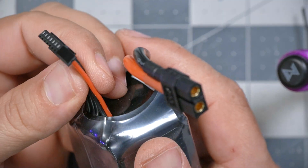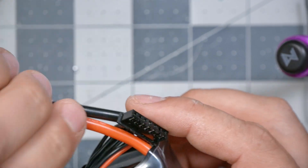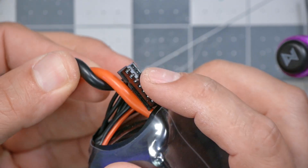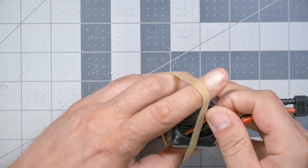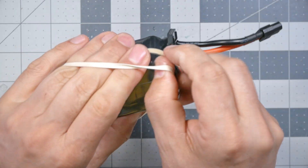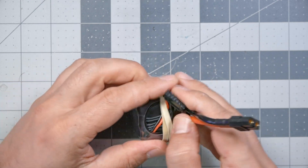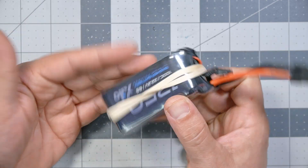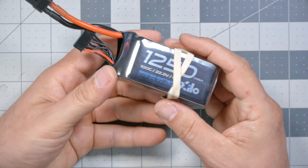Here's how we're going to prevent that. For the balance plug, some people like to tuck it in between the main discharge wires and give them half a twist — that should hold it pretty securely. Personally, what I like to do is take a rubber band. You can even buy tactical military rubber bands which are black and thick and last a little longer. I'll put a rubber band on like that. My technique is that when the battery is finished charging, I put this strap on — that indicates the battery is fully charged. When I finish a flight and the battery is discharged, I take that strap off and put it on sideways, which indicates the battery is discharged and I wouldn't want to fly with it. Whatever you do, you have to restrain that battery strap in some way.